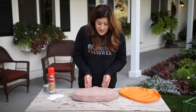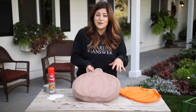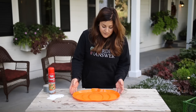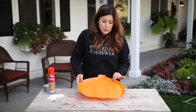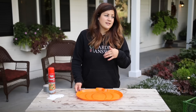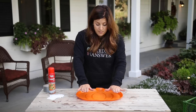So I did figure out how to make it thicker. I played around with it for a little while and played around with the mix of concrete that I used. So I'm just going to show you how I did it. The first step obviously is to make this thicker because a stepping stone this thin would not hold up very well. You want to shoot for something that's right around at least two inches, and that way you'll get a lot more time out of it without it starting to crumble.